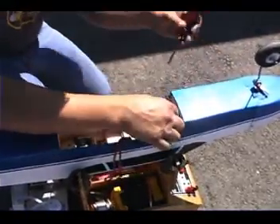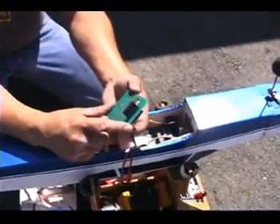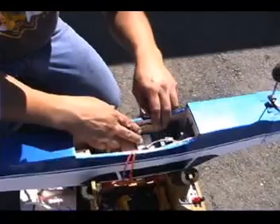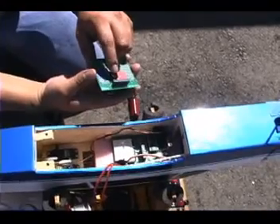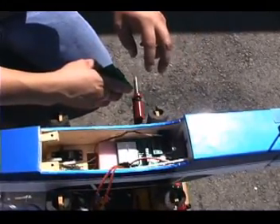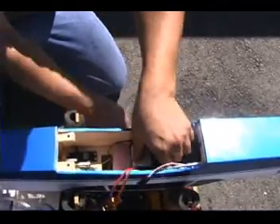Since there's so much vibration, everything has to be vibration-proof. That's just a couple of resistors needed to manage the infrared emitter and sensor, done on a little board with connectors to facilitate them. The heart of the matter here is the Basic Stamp itself — through these connectors it reads the sensors, fires the emitters, and reads the sensors. Information is passed through this header to the Basic Stamp, which reads and averages those readings and then calculates.